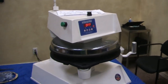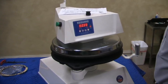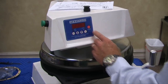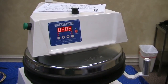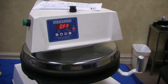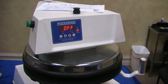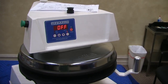It's funny, I could start all over the place, but when you power on the machine, it's going to go through a series of, those 8 digits represent a segment check, right? All the segments are working. And then it goes to a revision number of the control. Kim may ask for that to see what level of control they're on. I'll do it one more time. This one's set at 4.09. What's our latest, you know? We're going to give you some material after, because we're going to take our notes. We're going to create you a troubleshooting guide, and we're going to tell you what the latest revision of the controller is. This one here has been in engineering. This controller is old, so 4.09 is not the latest rev, but it's not important right now.